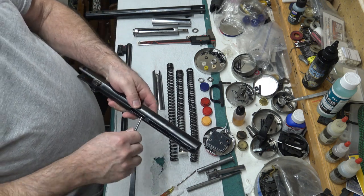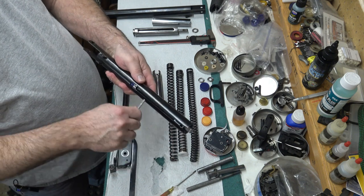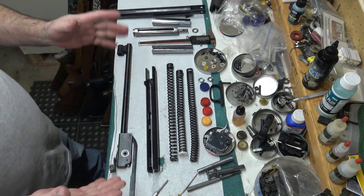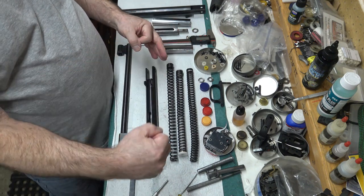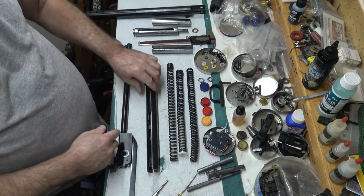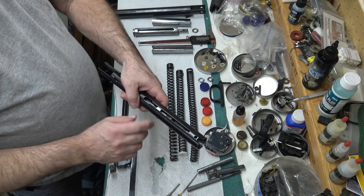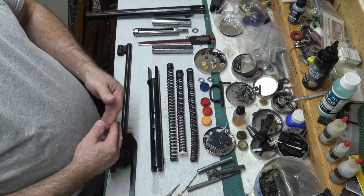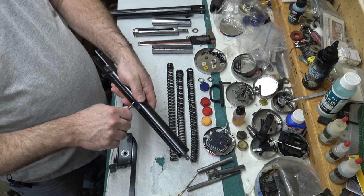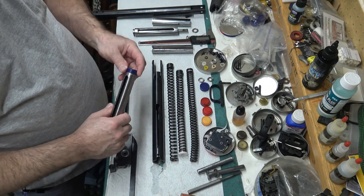She's not brutally tight - you can work it back and forth. We'll have a different piston seal for the final assembly. Normally at this point I put the gun together, cock it, shoot it about 20 times spaced out so I don't overheat the air chamber, then take the gun apart and check if it feels a little easier. If it does, I may leave it or take a little of the seal face down. That's what we found in this gun - you have to find things out on your own and see what works.